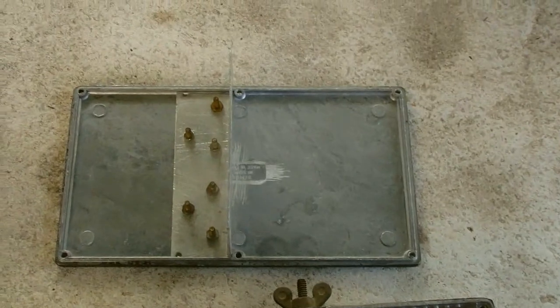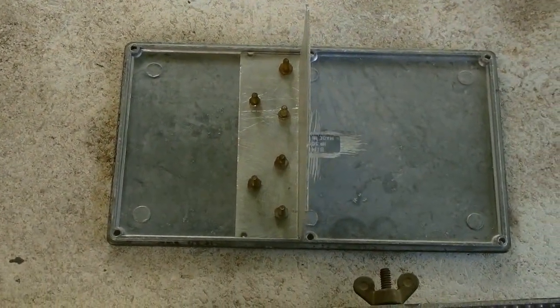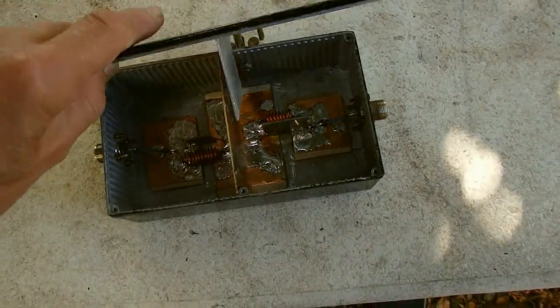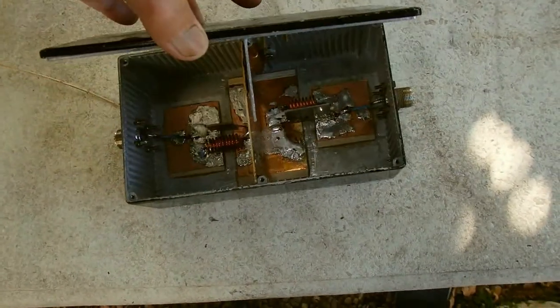In order to keep the two power-tuned circuits totally separate, I have actually put a screen into the lid as well. Notice the double screen - this is how the filter goes back together again. Why would I use a filter designed against interference for TV stations of a bygone age? The reason is that the filter, although specifically for two spot frequencies, also attenuates over a wide band. Therefore it reduces interference to domestic equipment that may not have any appreciable resistance to strong signals anywhere in the house. With the filter in, I am reducing interference to sound and entertainment equipment.